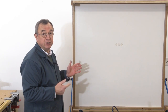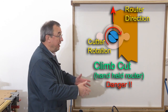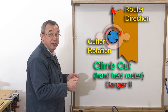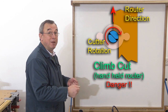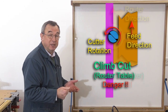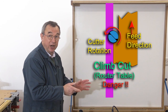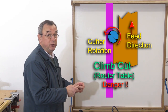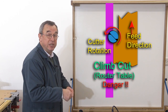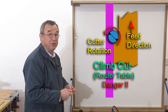The climb cut is the exact opposite — it's as though you're working with the workpiece on your left and the router on the right. The reason this is dangerous is because the router is going to try and start galloping towards you, and you may lose control. On a router table this is even more important, because you may be feeding a piece of wood into the router with your hands — you should have push sticks. The router can grab that piece of wood and either take it away from you or throw it back towards you, with alarming consequences.